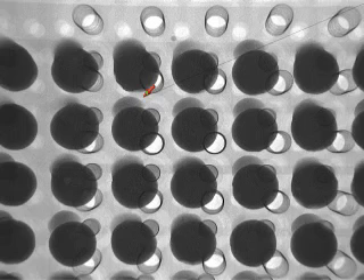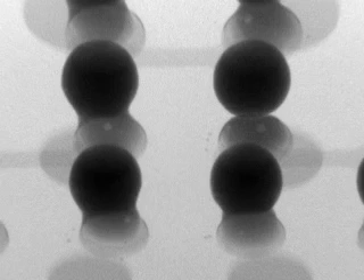Ideally these pads should be directly in the middle of these balls, but on this image you can see that they're slightly above and slightly to the side. Here we've also got four solder balls — three of them appear to have formed solder joints with the bottom side, but there's one in particular which hasn't, and that's essentially forming an open joint.